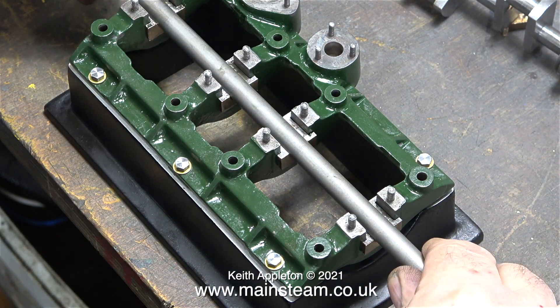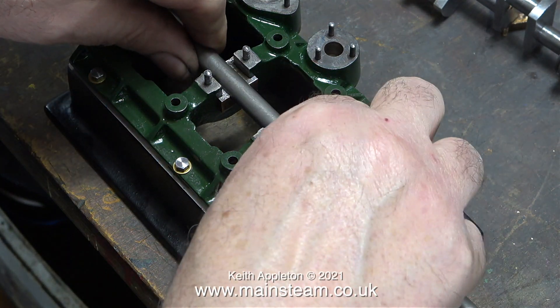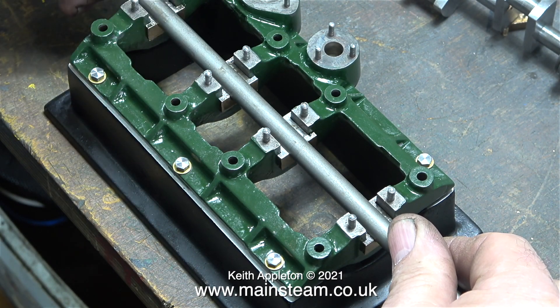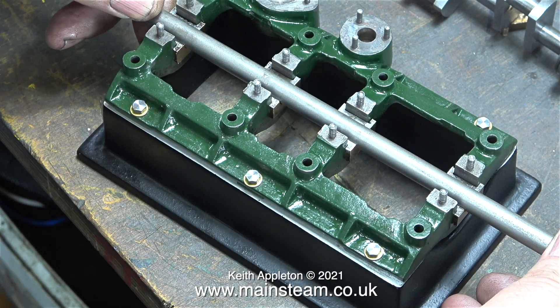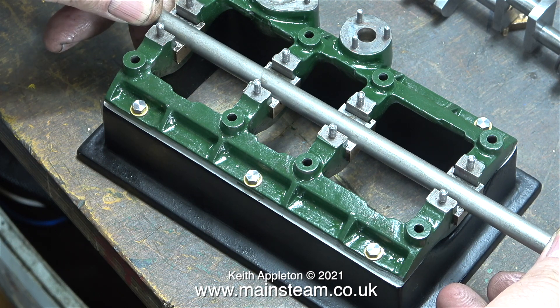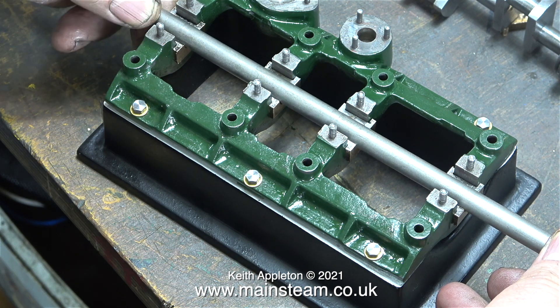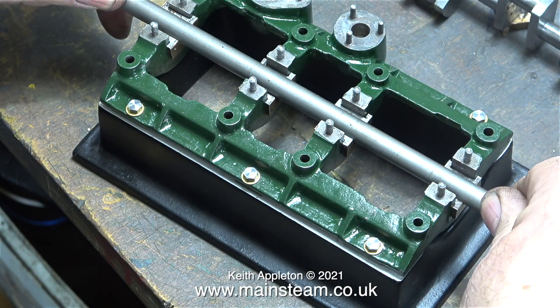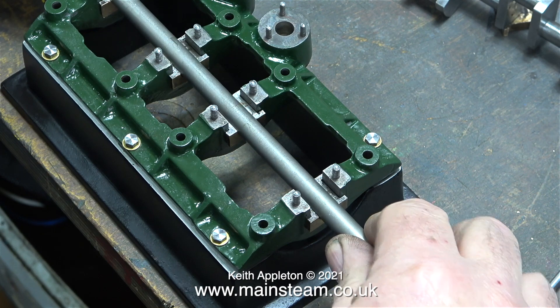After some more gentle tapping, I found that no matter which way I put the shims in place — and bear in mind they're all the same thickness — I couldn't get it perfect. So I cut one more piece of brass very slightly thicker. In this clip the bearing half second in from the right is too high. After a bit more packing and unpacking, finally the piece of silver steel ran accurately in the bearings.